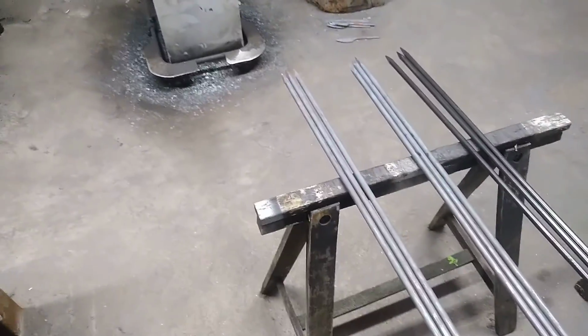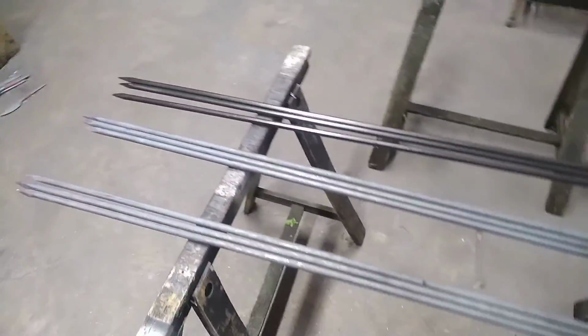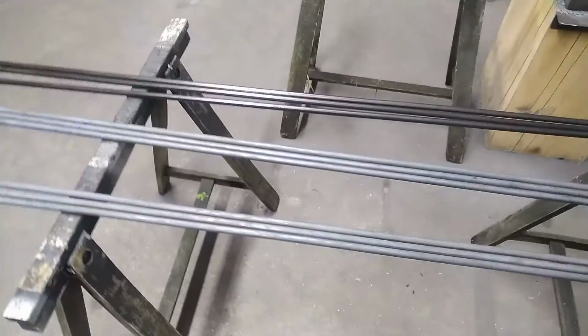Obviously you can do this, we're using oxypropane. You can do it with a MAPP gas torch or just an ordinary blowtorch. It will take a little bit longer. That line might not be quite so obvious, but it still certainly works. That's why we say to get things above about 150 degrees C, so you know that everything's hot enough that the moisture's been driven out.